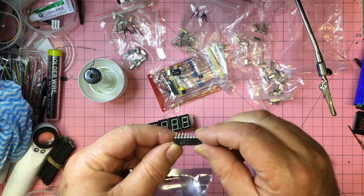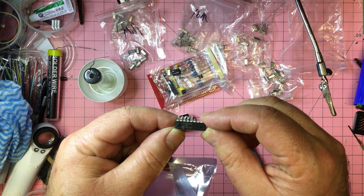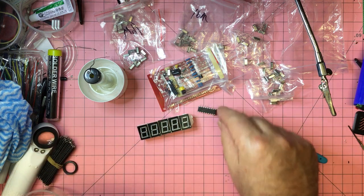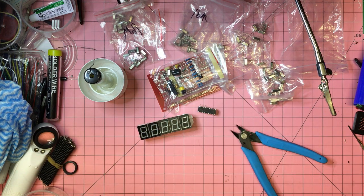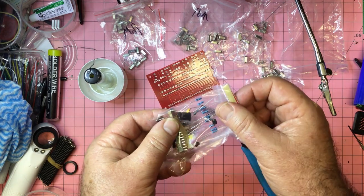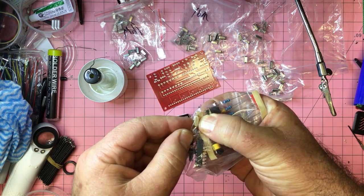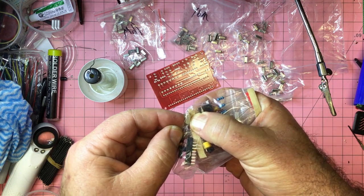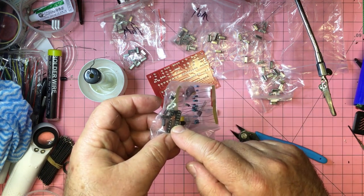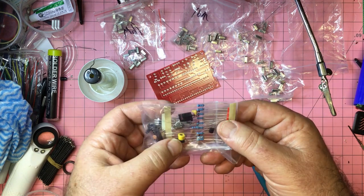It is a PIC. So I can't quite read that. PIC 16F628A. I don't have any experience with PIC, so I'm assuming that it is pre-programmed. And then there's a power jack there. There is actually a crystal in there, presumably that's used as a reference. So who watches the watcher? That is 20 megahertz. And that's presumably where you put the IC in. There's a button, some capacitors.